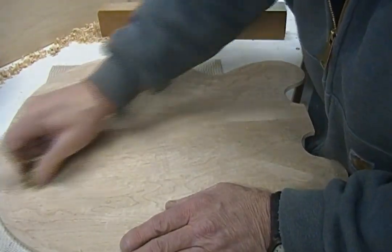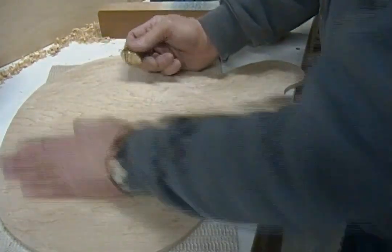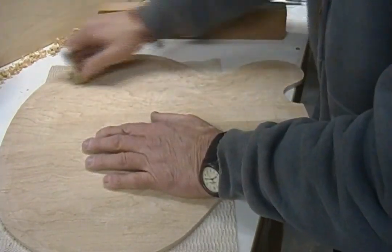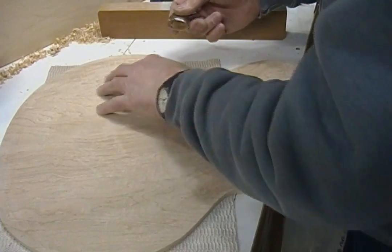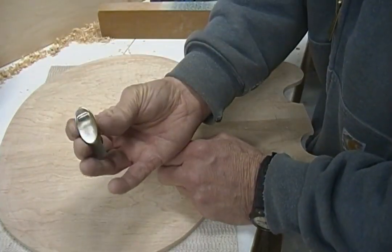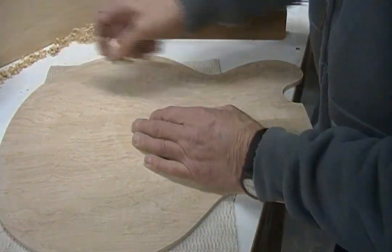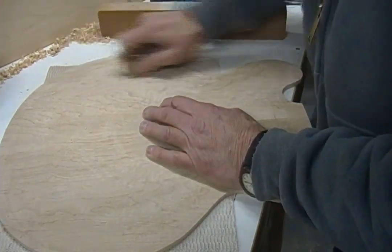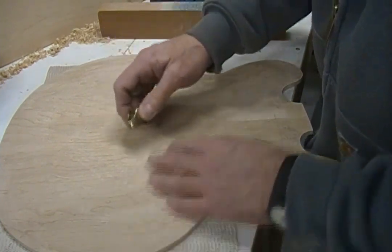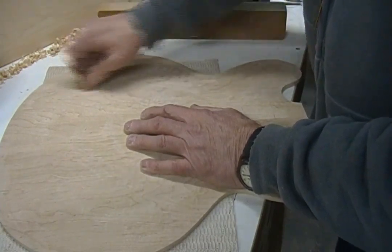And I'm not sure you can see, but I'm just barely getting any kind of curls off of it at this point. Then the other thing I did, and I went this way too, because as you go downhill, it's a curved blade, so you end up with little divots in between each run down, you get it, and then it always wants to go back into the same groove because of the little ridges, so it's like getting stuck in a tire rut. You just keep repeating the same thing.